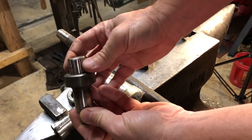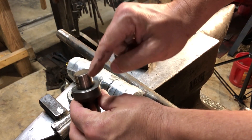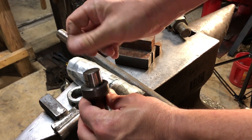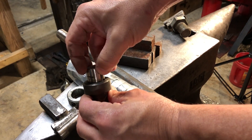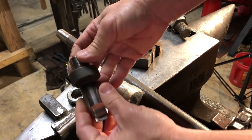That keeps the tool from upsetting inside the FlyPress. The massive force a FlyPress pushes down on a tool — if you have it too long and pushed up into the ram, it can upset the tool and get it stuck. So you need some kind of a shoulder to prevent that from happening.